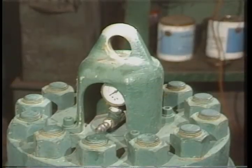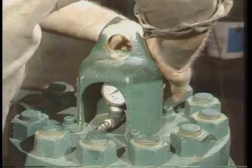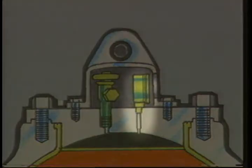For the Continental, open the dampener charging valve slowly. Look at the gauge and you'll see the pre-charge pressure in the diaphragm. Let the dampener stand like this for 15 minutes or so. In the Hydril, the gauge taps directly into the pressurized space, so obviously you don't have to open the charging valve to read the pressure.